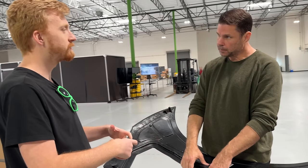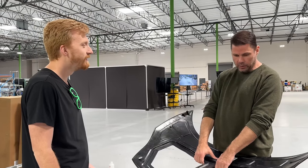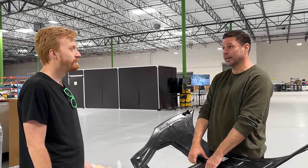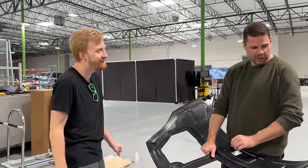Is there a 12-volt to service from the hood? No, it's in the rear — it's a lithium 12-volt battery. So many companies haven't switched to lithium 12-volt yet. Every 30 pounds of weight you add to the Aptera you lose a percent of range, so adding 15 pounds for a lead acid battery wasn't an option — and that's great motivation to lose weight.